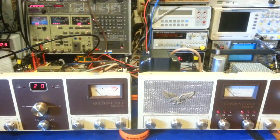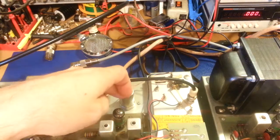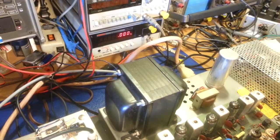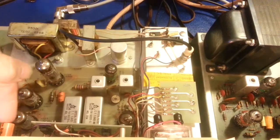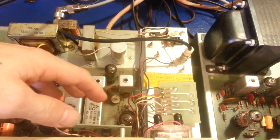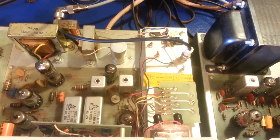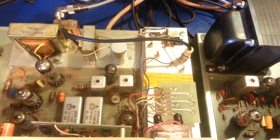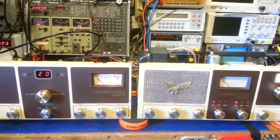The only thing I would do to it if it were my radio would be to change the electrolytic capacitors. There's not a lot in the high voltage system — a couple big ones on the underside, two small can caps, a big can cap, and a couple on top of the circuit board. The majority of electrolytic replacement time, other than the two can caps, is going to be changing all the small low-voltage electrolytic caps on the circuit boards. The channel selector module is a pain to get out — it's a maze of wires holding the two boards together. I'd also change the high-wattage resistors, though the ones on the top side don't get as hot as a Tram. There are a few on the underside that do get hot, so I'd always recommend replacing those. There you go — Browning Mark 4 Golden Eagle, another squealer back up and ready to run.